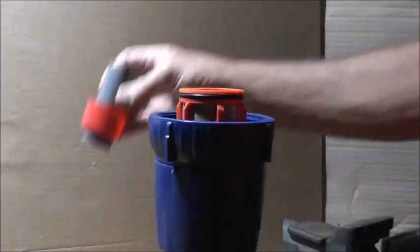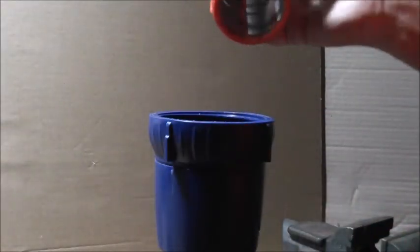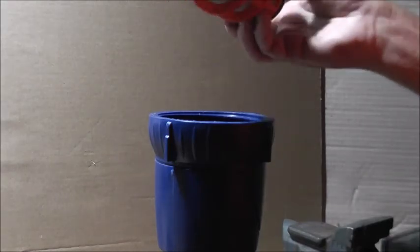When you install it, just put it back in the tube with the chamfer on top, just like that. The screen you can simply pull out — there's an o-ring around the bottom and it's just a 50 micron stainless steel screen. Just take a good nylon brush and keep it cleaned up. I brush mine inside and out whenever I service it.